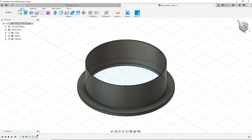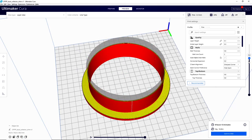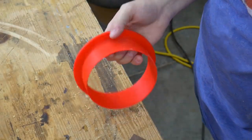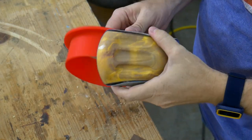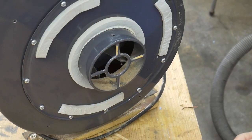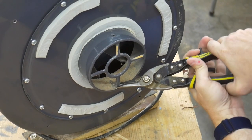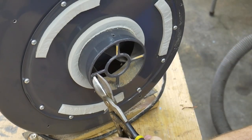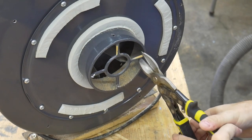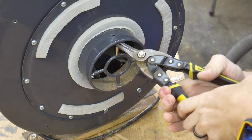To prepare the mating of the dust collector to the cyclone, I designed and printed a shim to adapt the cyclone output to the dust collector input. There was a little slop in the fit-up, so the shim should help eliminate any suction loss at that connection. Also, in the name of efficiency, I removed the protective grate on the dust collector input. It is placed there to protect the impeller from large scraps or pieces of wood, but with a cyclone between it and the suction hose, large debris will never make it to the dust collector anymore, so the guard can be removed.